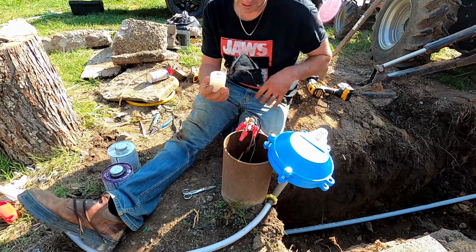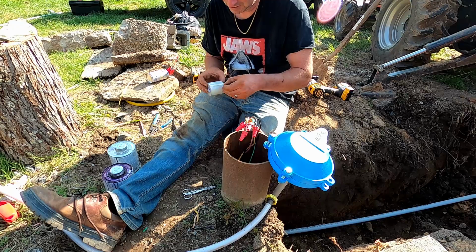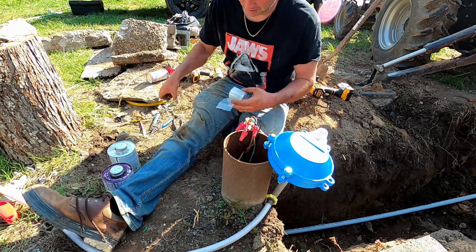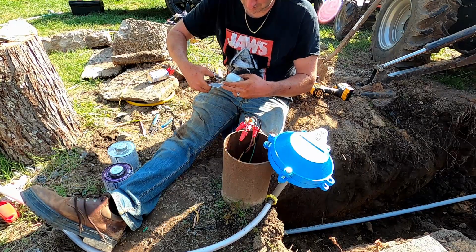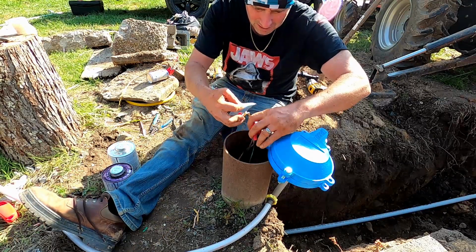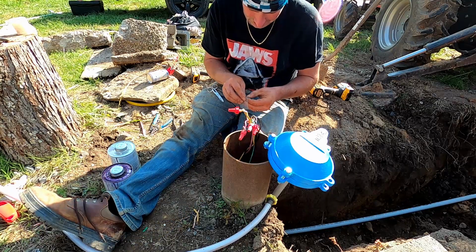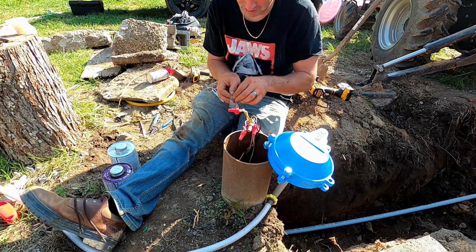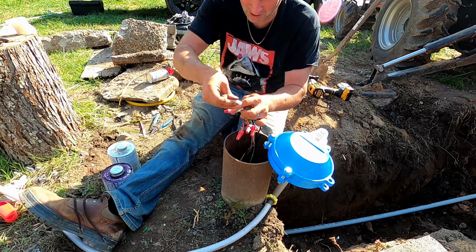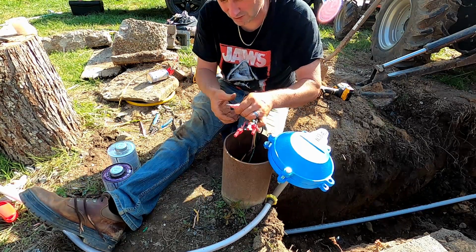So this stuff, it's made by Shark Bite, the PEX company, and it's kind of amazing. It's not sticky at all. So you take a slice like that. Now this is for underground use. If you have a brass connection or something and it's going to be underground, you're supposed to use this stuff around it, but it just goes on, and as soon as you start wrapping it over, it makes this really nice watertight seal.